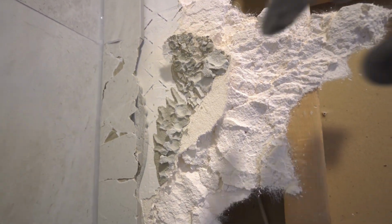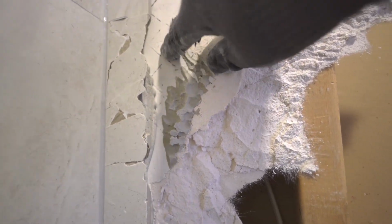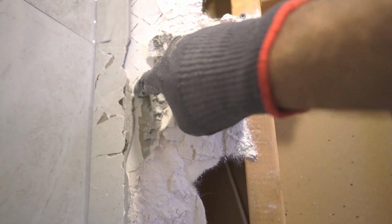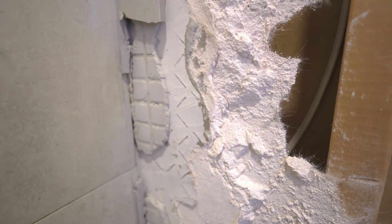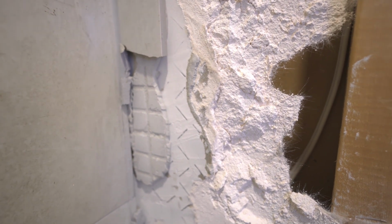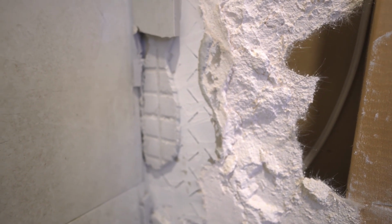I've been seeing some large pieces of the Diamondbacker that has this pattern on it without any apparent thinset attached to it. And what I realize now is that not all, but some tiles have been mounted for the sake of convenience purely with some beautiful spot bonding, leaving all the surrounding backer board with no coverage. Now, I know this is Canada, and the TCNA, the tiling authoritative body, says 95%, but I'm sure we have similar rules hidden somewhere in the guidelines. Apparently my handyman doesn't read much.